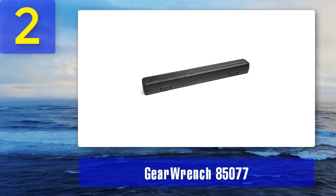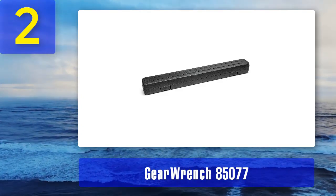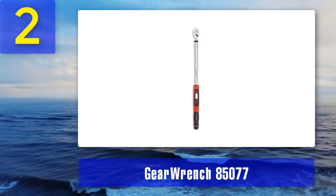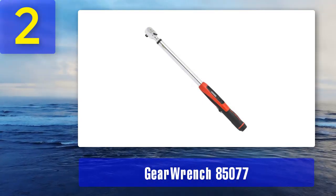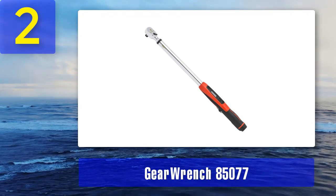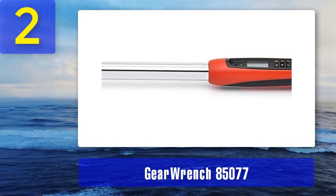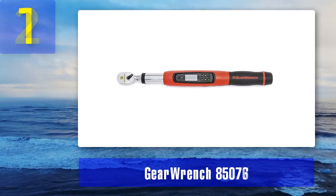The tool can measure torque both clockwise and counterclockwise with an accuracy rate of plus minus 2% and plus minus 3% respectively. It delivers from 25.1 to 250.8 foot-pounds of max torque. Like the previous version 85076, this wrench features an outstanding alert system with a vibrating handle, a buzzer beeping sound, and a solid LED light. All of these three alerts will trigger at the same time to notify users when the torque reaches its desired level. Pros: wide torque range, outstanding alert system, great accuracy. Cons: drains batteries fast.